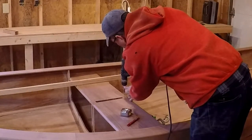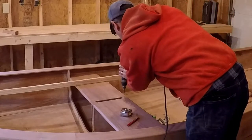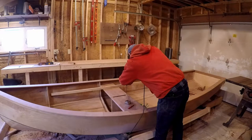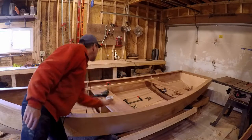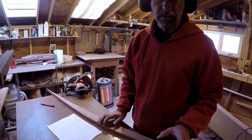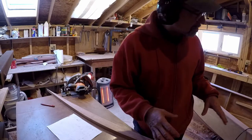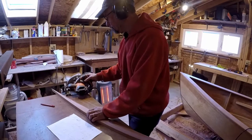Countersink it, and these I think I will leave in the boat — stainless. All right, got a screw here, screw there, one here and one there — but that will give us our reference point and I can make the legs. We need a total of eight of these little posts holding up the other edges of the thwarts, and they range from eight inches to twelve inches each. I think I can get them all like this just for convenience.